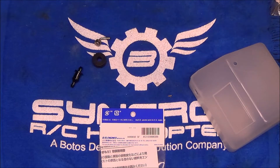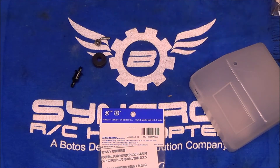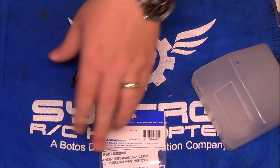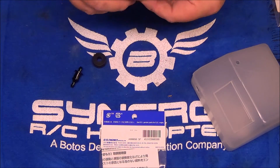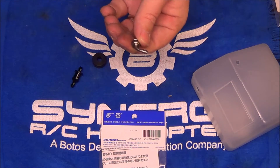If you're going to use the stock N7 clunk line, you want it to be 100 millimeters long. Since I'm using the OS bubble-less clunk — which is a little longer than the standard clunk — and through trial and error with a previous pre-production kit, the ideal clunk line length for the bubble-less clunk with fuel magnets in my opinion is 90 millimeters. So that's what I'm cutting mine to. The other piece of this kit looks scary but it's really easy — the trick is the metal fitting for the vent line.